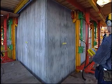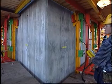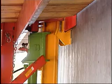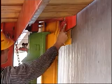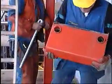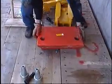The formwork climbs 600 mm for each stroke of the hydraulic ram. The climbing speed is 0.2 m per minute. Climbing formwork could not be safer and more cost effective. The formwork is secured at the climbing shoe with the bearing plate, then the load on the hydraulics is released. Work on the previously concreted section is carried out from the finishing platform safely and efficiently.